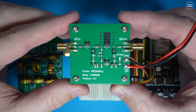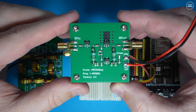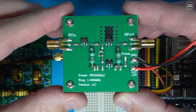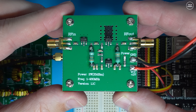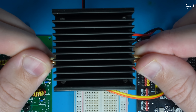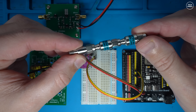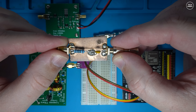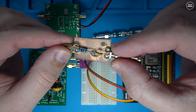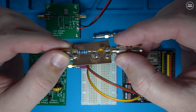Rather than rely on calculated output levels, I decided to try a 2 watt RF amplifier that according to the specs will work from 1 MHz to 930 MHz, needing only around 1 milliwatt input for a full 2 watts output. I don't want to run 2 watts on whisper — that defeats the object, since whisper stands for Weak Signal Propagation Reporter. After trying various attenuator values I ended up with 26 dB of attenuation. I also made a small board with a 100 ohm resistor and 100 nanofarad capacitor to provide a small amount of attenuation and prevent any DC from the SI5351 entering the amplifier.